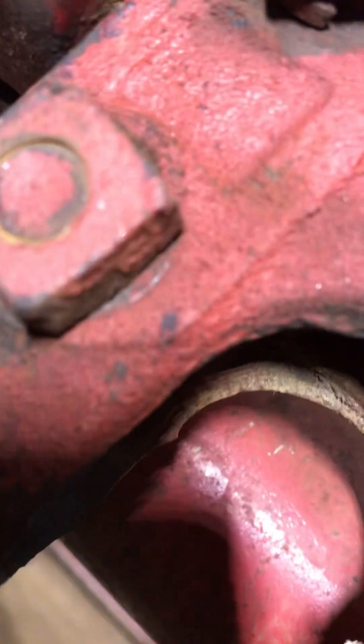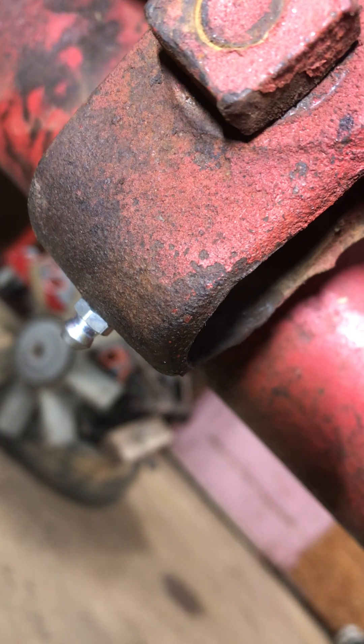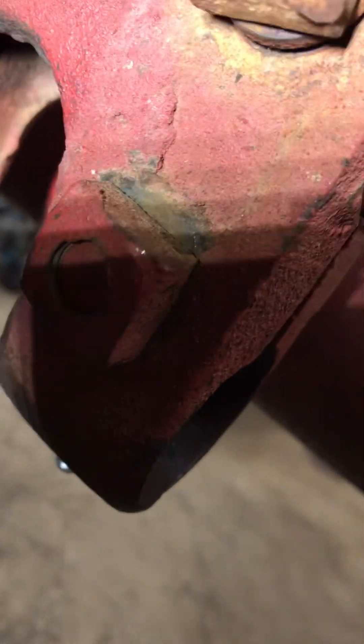I laid on my back and took this one apart because I was thinking that piece of metal wasn't going to be thick enough to drill and thread deep enough. But you don't have to take it off. I drilled that one right on the creeper laying on my back and threaded it — you can see what it does. That one did wonderfully. It pushed grease out of both sides on the bottom. I'm not worried about the top; they always wear on the bottom. When you're going forward your pressure is on the bottom — you're pushing the frame back to the rear of the tractor, so it always wears the bottom piece.